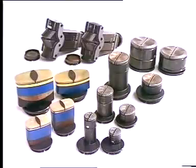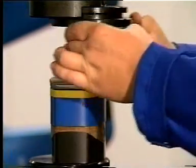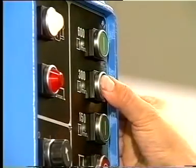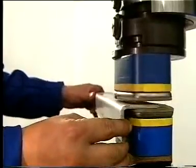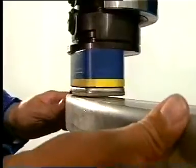These are the tools for shrinking, shown here in a brief overview. This tool, whose working surfaces consist of a special laminate, is employed for gentle finishing of surfaces in aluminium or stainless steel which will later be exposed to view. The gentle surface treatment method also applies, of course, to tools for stretching, doming, flattening and so on.